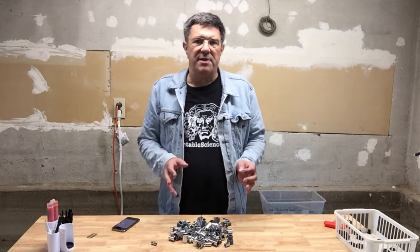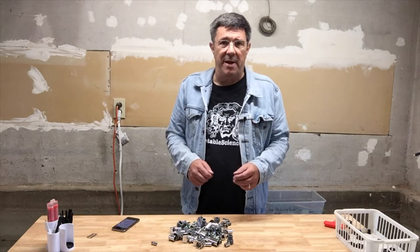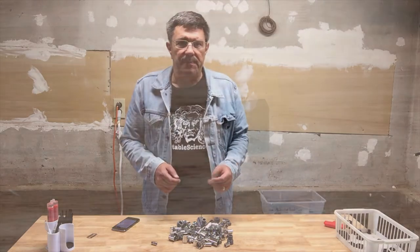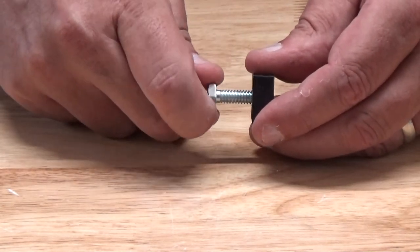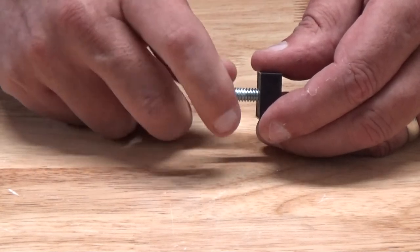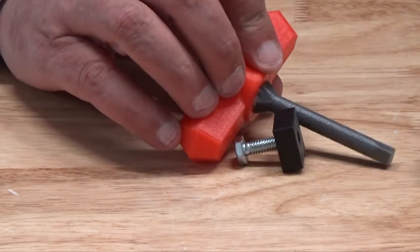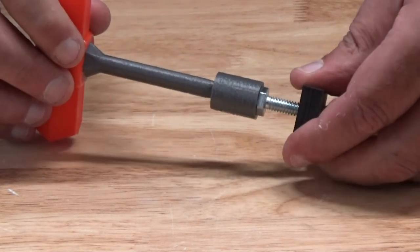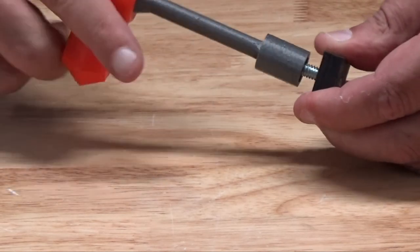While the demands of our fasteners mean we use 3D printed nuts and bolts almost exclusively, sometimes the thread fits so tightly coming off the printer that it puts too much strain on the plastic parts. To make things easy, we help things along by effectively tapping out our holes and threads after the part is printed — we take the printed part and, using a metal nut or bolt as our die, screw and unscrew the part multiple times until the thread fit is what we want. For that application, these sockets work perfectly. We print off the drive handle we need from the available files and we've taken care of our post-printing thread treatment needs.